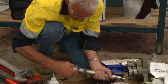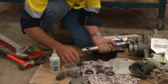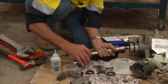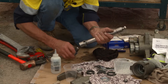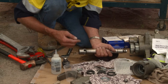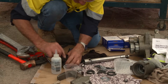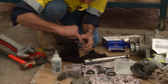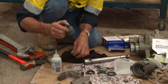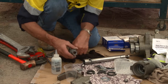If however that ball did leak, what you would do is take that compromised ball out, put it to one side, put the new ball in, put it in the retaining cage, screw that back in, and do the same procedure again. If it continues to leak with a new ball in there, you only have to wipe all this clean and ensure that there is no damage. If you do find damage, that renders this inoperable — there's no point in putting it back together if it's leaking out through the bottom of it.